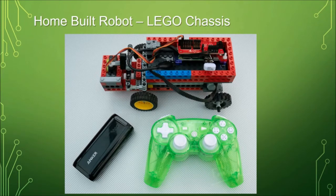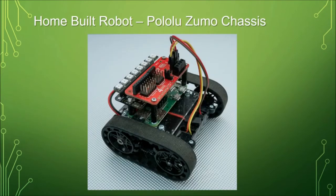You can plug any Lego motors on. At the front we use a servo — just a hobby servo, completely unmodified. I built a Lego chassis shape that was just the right size for it to slot in, and it engages with the steering rack. This tracked robot moves a bit beyond the kits — the tracks and base with a four-cell battery holder come as a chassis kit, but you decide what electronics to put on. I added a sheet of Perspex, drilled four holes for the Raspberry Pi and four holes lining up with the chassis holes, so it acts as a mounting plate.